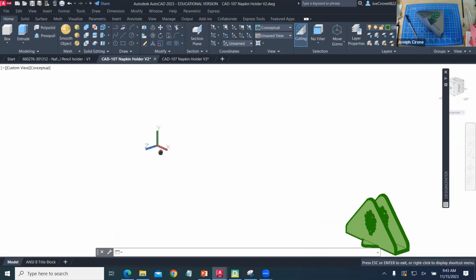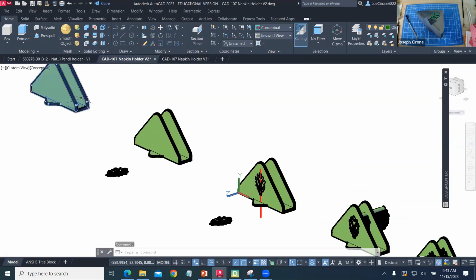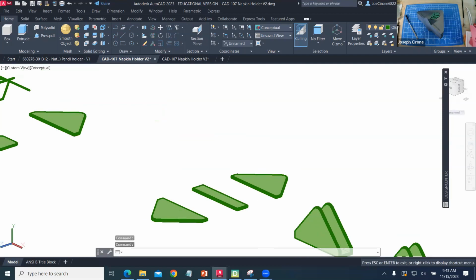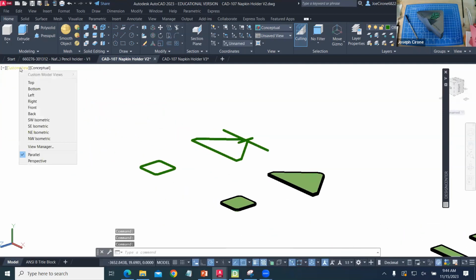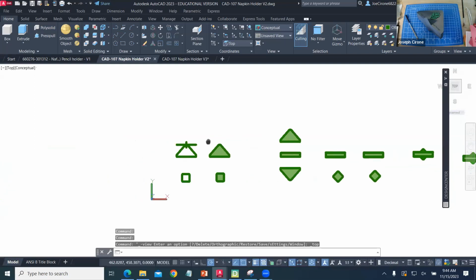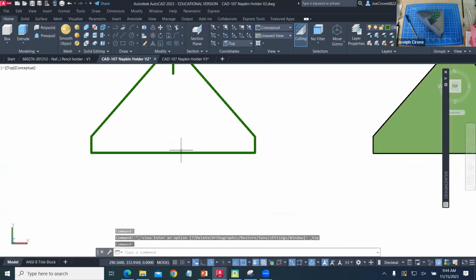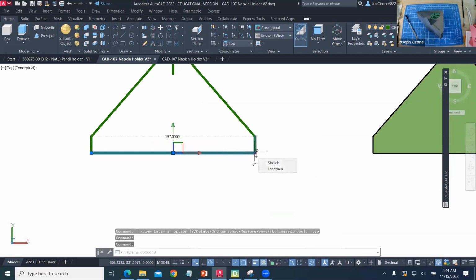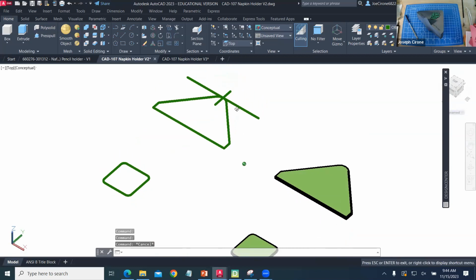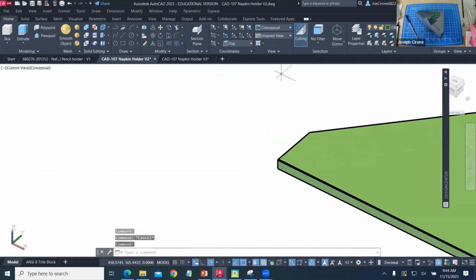And what we've done is we've outlined it like we've done in other modules, where we'll start off with the original CAD geometry. And if we take this in the top view, and we analyze it, we can click on that, hover over one of the grips, and we can see that it's 157 millimeters. And then we basically create the part according to the geometry, and then we extrude it with a thickness. And if we want to analyze the thickness on that, we can measure the distance.